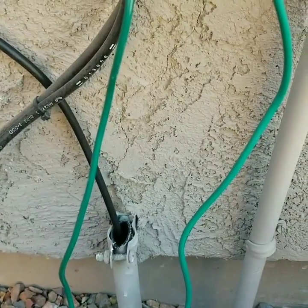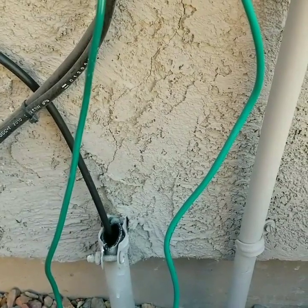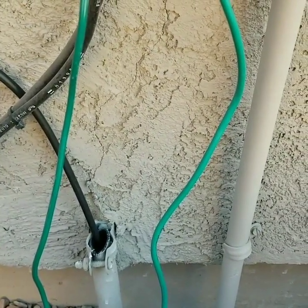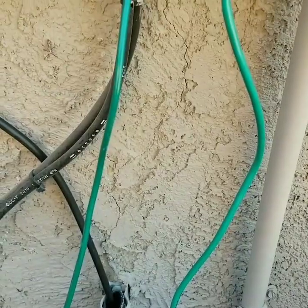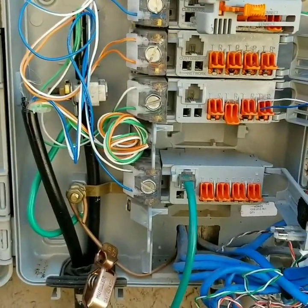This account is going to be an installation of internet, but it's a bonded service. That means we have to get two lines to the home — two separate lines feeding service — and then the modem unites them inside at the house. What I'm doing now is checking from the NID to make sure that the lines go from the NID all the way to the cross box.